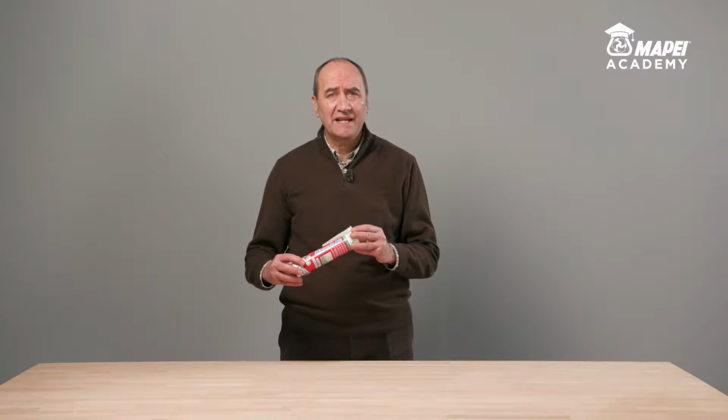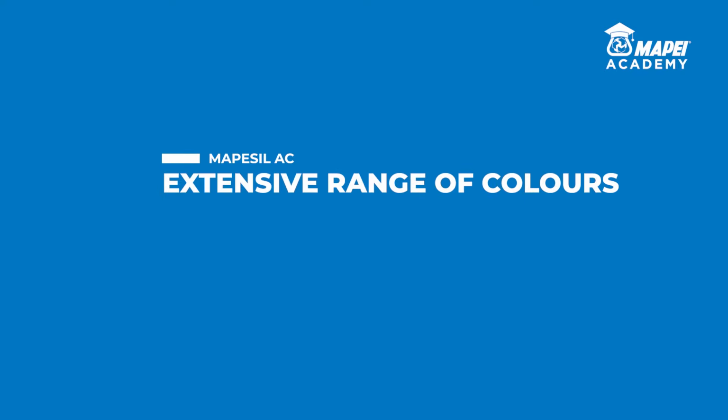Today, I would like to present Mapesil AC, a pure acetic silicone-based elastic sealant specific for internal and exterior use for applications such as bathroom fixtures, ceramic, damp environments in general, and swimming pools. It's the ideal product to form elastic seals against air, dust, heat and noise in joints and cracks subject to movement, and to create fillets to blend in different construction features.